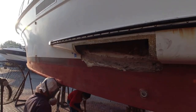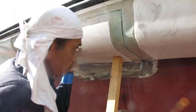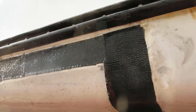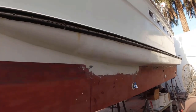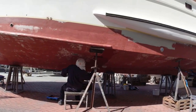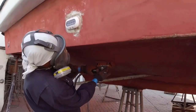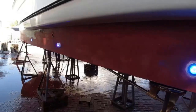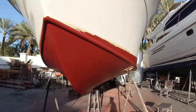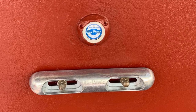We had to cut a section out of the exhaust because we could see debris inside but couldn't pull it all out, so we decided to remove a section entirely. Here's the carbon fibre going on - makes it look so easy. Once the carbon fibre was done, I applied filler and sanded it, then prepared it for a primer coat. You couldn't see that a repair had been made - really pleased with that. Then it was time to prepare the anti-fouling, which didn't take long. At the same time we cleaned up the props, shafts, and supports. With the lights all on and working, the boat looks virtually complete. There's the new anode on - we checked for continuity, it was there, so we know it provides full protection. Ready to go back in the water: in position, let the boat down, unhook, and out we go back to the berth.